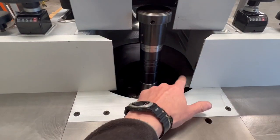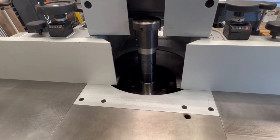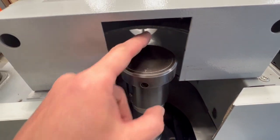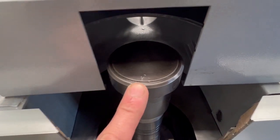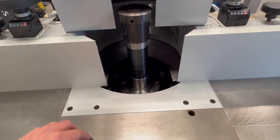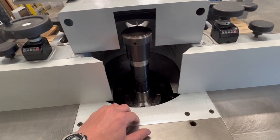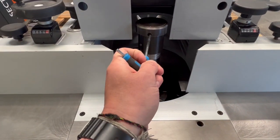If you want to get even closer there's another plate in the back. On the quick nut, if you look at it you can see there are two grub screws — one at the front, one at the back. You need to be tightening and undoing the one with the Y symbol. All you do is put your cutter block on, put your collars on to suit, tighten it by hand and then nip it up.